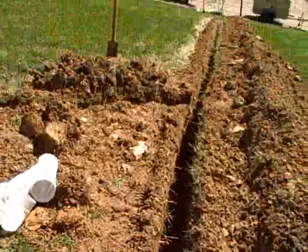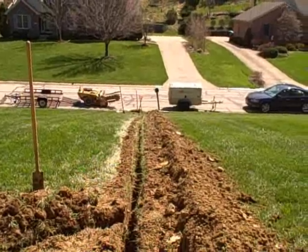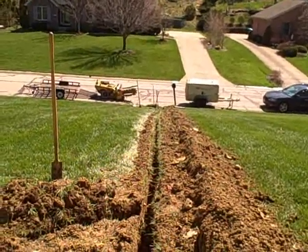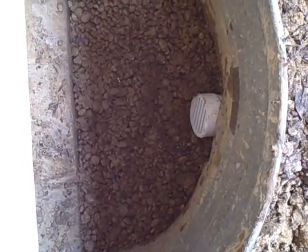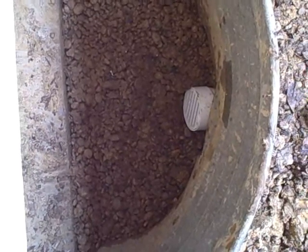And everything will connect, run on down the hill. That'll prevent your window wells from filling up with water and flooding your basement. We hook a piece of pipe up and run it out underneath the window well like that, and run it out the discharge line.